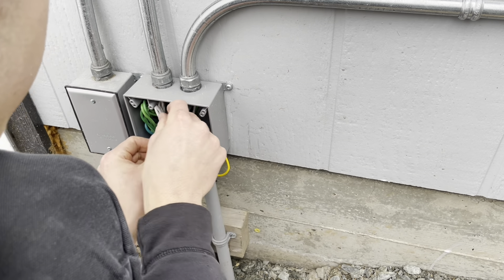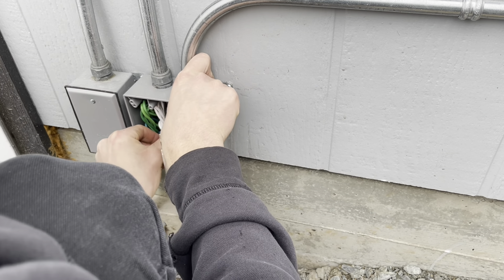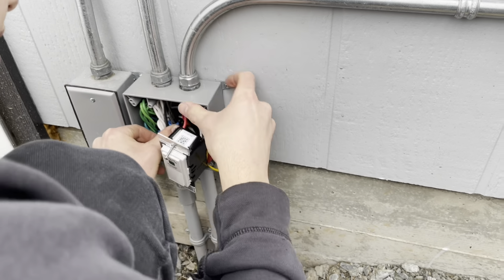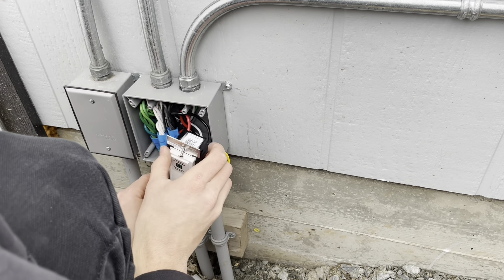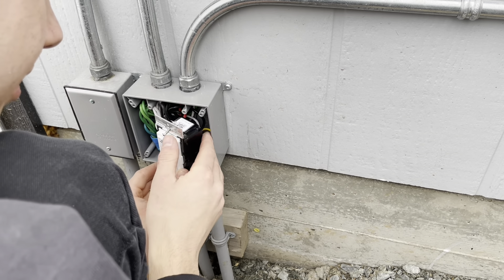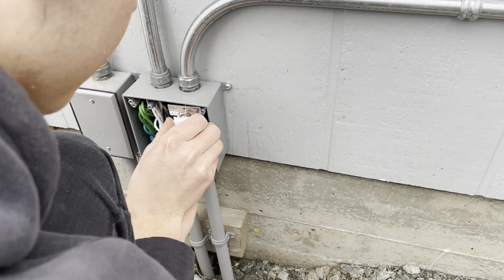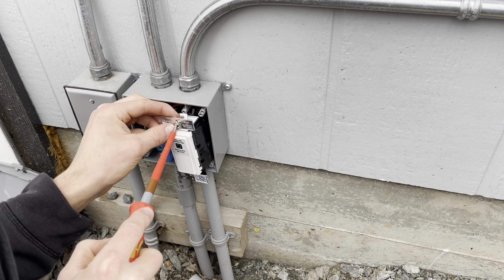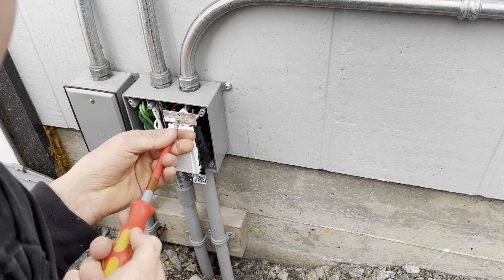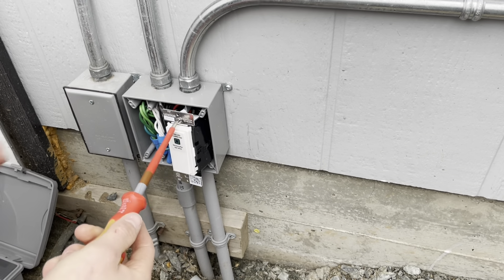All right, there you have it. I do usually like to splice outdoor connections upwards, but I don't have enough room in here to twist it that way — to go up and then back down. I don't know, that was a terrible way of wording that. Do we got space for that to go back in? Yes we do. I just want to get this end of it done so I don't have to reopen this outdoor box and turn off the whole circuit.